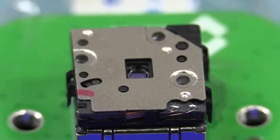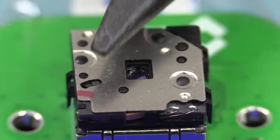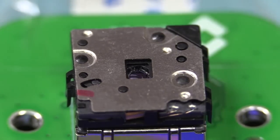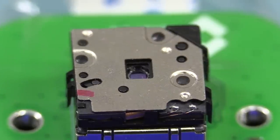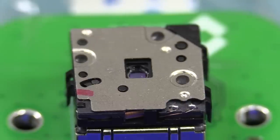I wasn't expecting it to have a shutter because the datasheet actually says it has automatic temperature compensation. Really, since it's not actually measuring absolute temperature data from the Lepton output, I didn't think it would need a shutter. So I'm quite surprised that it does. They've gone for this little, presumably cheaper and simpler, integrated clip-on shutter on the top. When the shutter closes, it'll take about half a second to do a thermal correction — there we go, it just blinked. So it's got an internal surface with a nice even thermal temperature gradient on it, like a black body surface, so that it can do compensation against that uniform temperature.